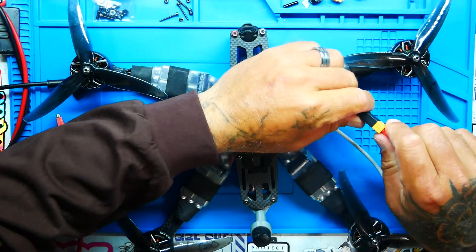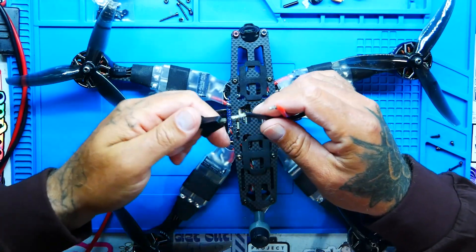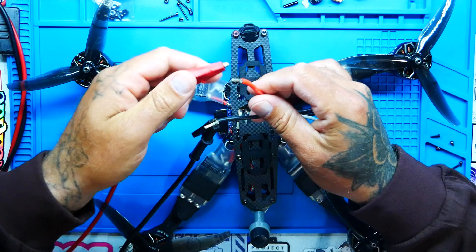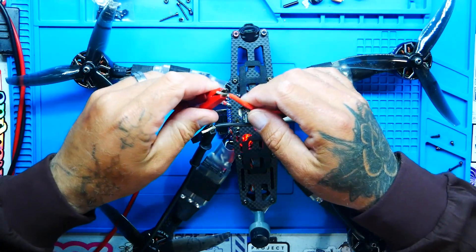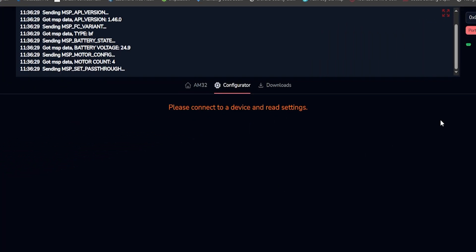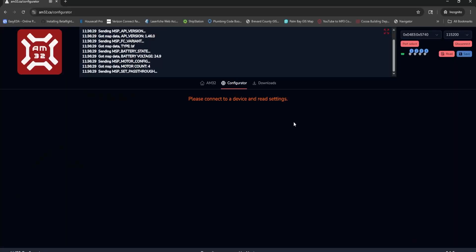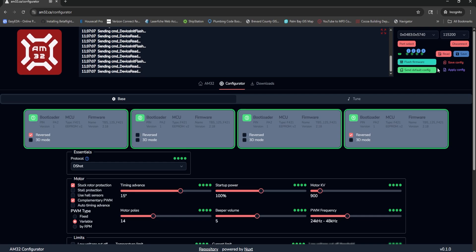So that's twice you would have been fooled. Now power it up — and never do this with props on. I'm running about 24.8 volts on my power supply. Now press connect, and as you can see everything is initializing. I'm getting all sorts of info: sending MSP, connected to my device, motors 1, 2, 3, and 4 with motor config. And now — and only now — you can press Read. Voilà, we are in, pilots!